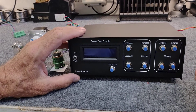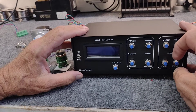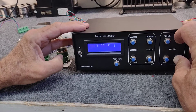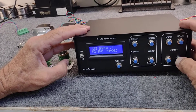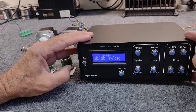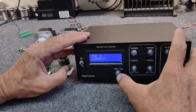The first thing that we do when we set up stepper tune is set the stepper motor current. We hold M2 and M4 down and power it up. This says enter the target current, and then we use M2 to increase the current set point and M4 to decrease it. So we'll set it to 4 tenths of an amp for these particular steppers.